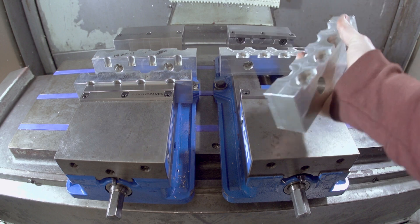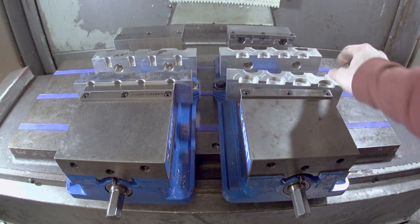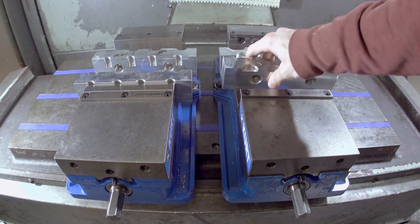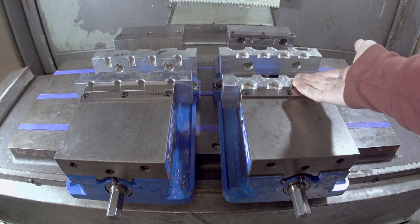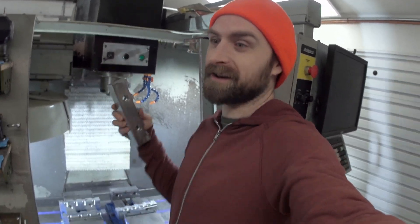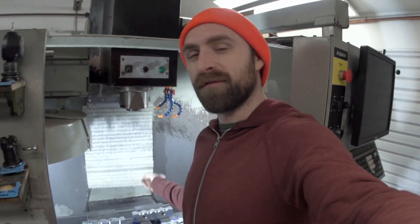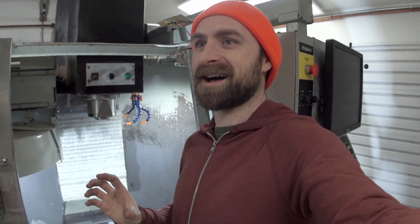Another issue is that to make truer skewers, I have to make 15 millimeter collars and 20 millimeter collars. Grouping the 15 millimeter collars and then doing another setup — unbolting these and flipping them around to make 20 millimeter collars — basically creates another setup for no reason. When I'm talking about doing another setup, I'm really talking about two things: taking the bolts out, flipping the jaws, and bolting them back on. But that uncovers another issue — before the bolts are tightened, the jaw has a little bit of play side to side, so the location of the jaw on the vise is not consistent.